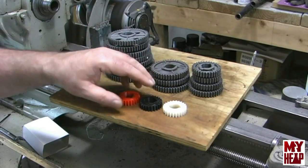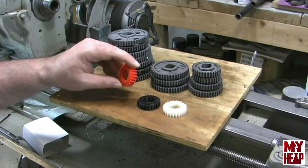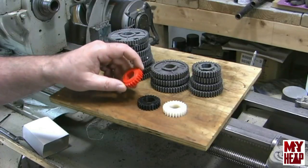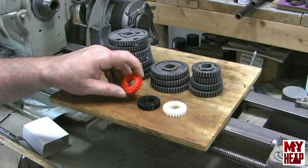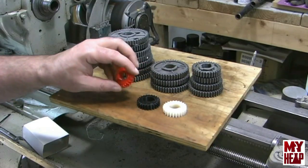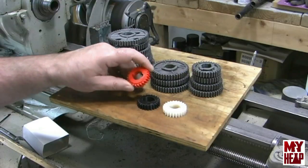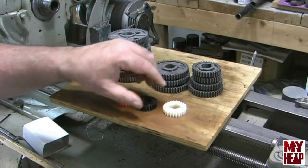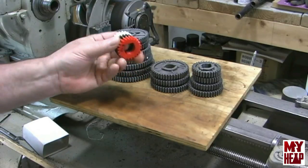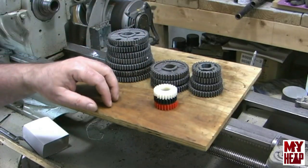One of these gears is needed for less than eight threads per inch, and a super fine feed has to have this gear too. I think we'll start out trying them in a super fine feed and maybe take heavier depths of cut. The 24 tooth gear is rarely needed, but I wanted a complete set. Anyway, they printed some gears out for me and I'm still trying to get my hands on a nylon one just for comparison. The form is very good — they're nice gears really. We'll play with those and see how that turns out.